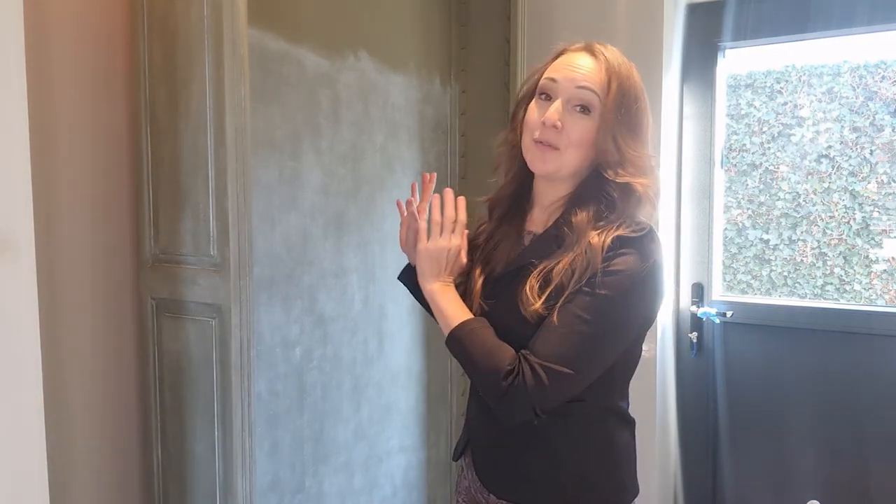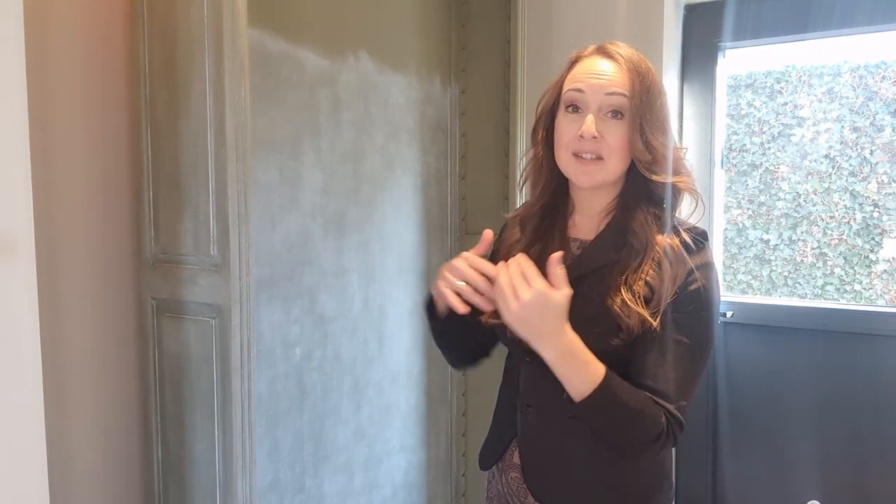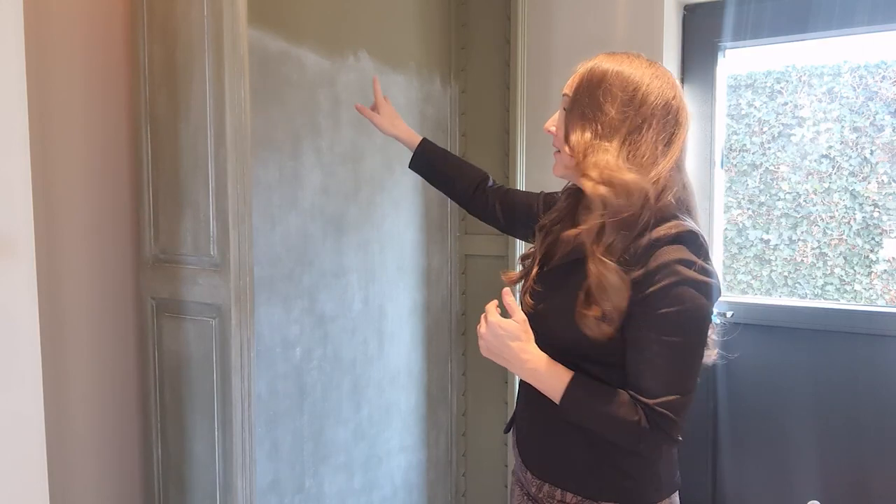I changed outfit because I have to run to the office right now, and because of that I wasn't able to finish my white wax on this back panel of the cupboard. When you have a big panel and you want to apply a colored wax - white wax, dark wax, black wax, whatever - please do it in one go. I had to split it into two parts and now I run the risk of having a visible line, but that's a problem for tomorrow. Right now I have to hurry to the office!